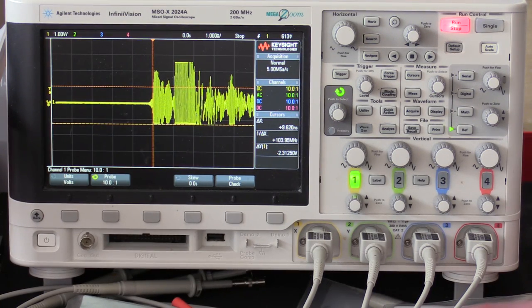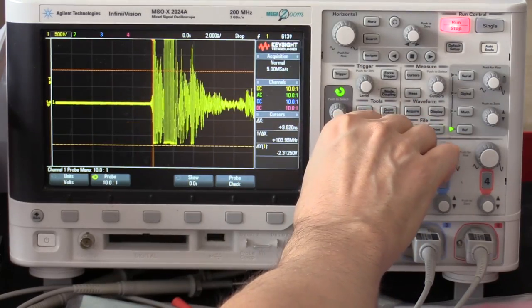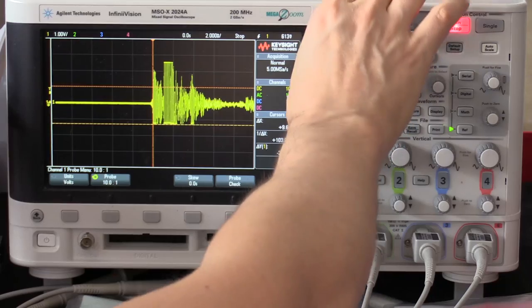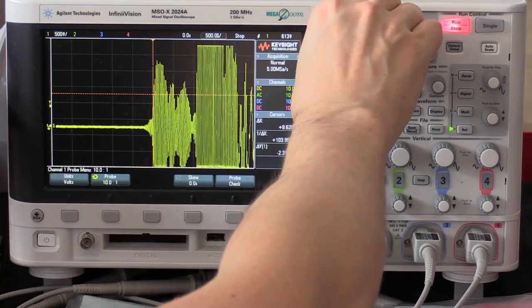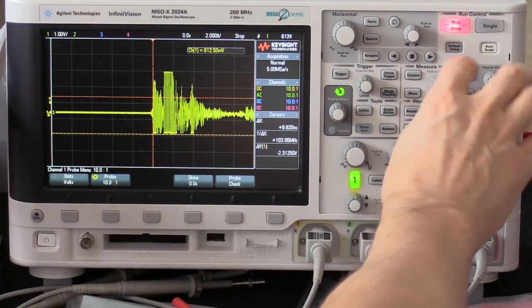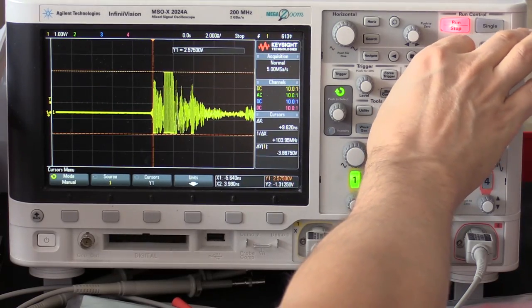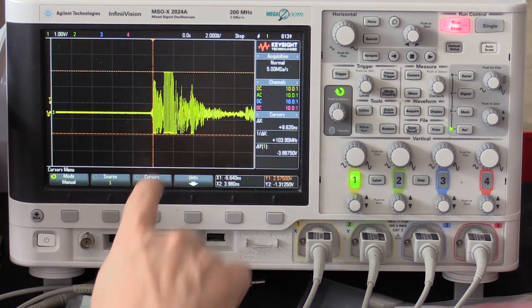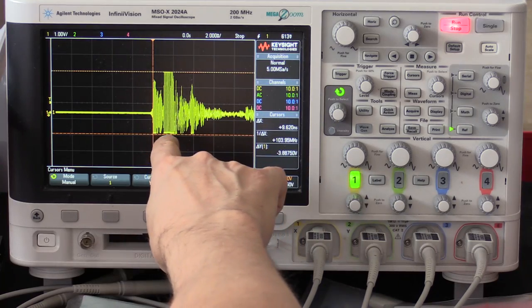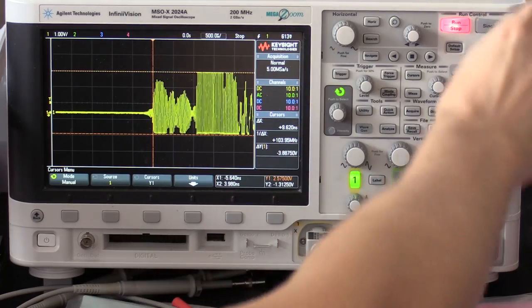This is a signal that comes straight out of the sensor board. So you can see one disadvantage, I'm not sure how it's going to work. Is it going to just ignore the signal or not? But if people start clapping during your meeting, you're going to get some very interesting results. And let me see the signal for this. Yes, this signal out of the ultrasound is capped at 2.5 volts and minus 1.28 volts. Let's do it again.